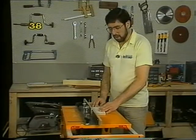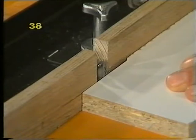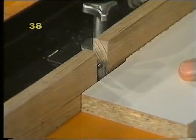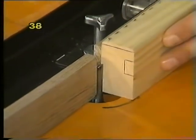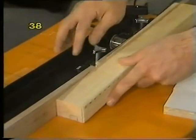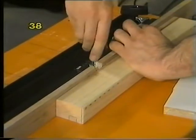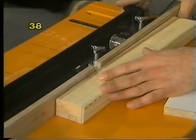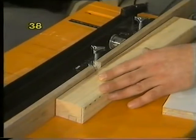That's straightforward when cutting all the way through a workpiece. If you want to machine a wide face in two passes, you have a different setup. First, set the two fences dead in line with a straight edge. Then move the whole fence back until the amount you want to plane off is represented by the gap between the straight edge and the two fences. Make sure that gap is fairly even — that's how much you'll plane off in the first pass only. You can often fit the safety guard. Then run the piece of wood through.